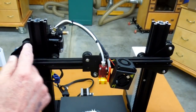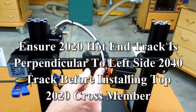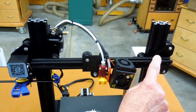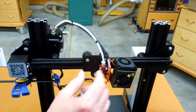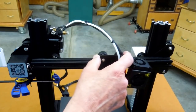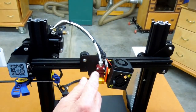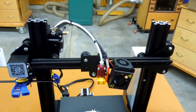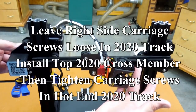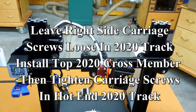Adjust the wheels on these two carriages before you put the cross beam on. The hot end trolley has to go on before this is attached to the beam. Take the fan off so you can adjust the eccentric to set the tightness of the wheels. Make sure these two screws are tight and that this is at right angles to your bed. You can put a clamp on here to hold it up so it doesn't go crashing down and damage your bed.